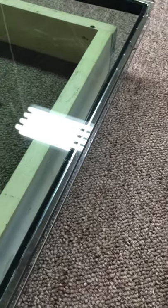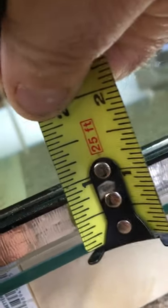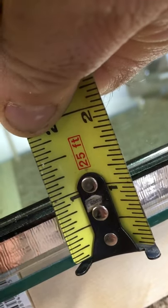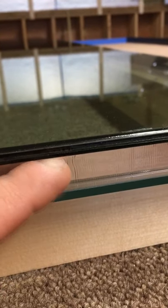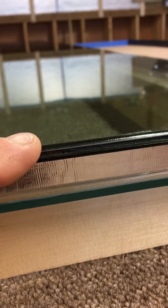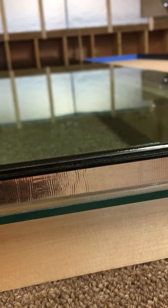The spacer material itself was somewhere near a dollar a foot. We used the five-eighths spacer because we were after getting the glass to one inch overall, which is the outside dimension of the unit we needed to fit in our aluminum frames. The five-eighths spacer made that for us, so we get to use all our existing gasketing, which saved us a lot of money.